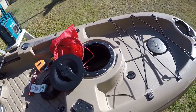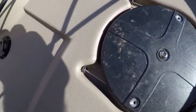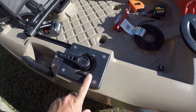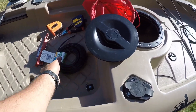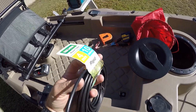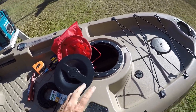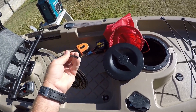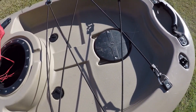What I'm going to do is swap these two wires over, but you'll see they've melted over the ends so you can't just pull them out - it'll be the same underneath, which is a bit of a pain. So I've gone to Bunnings and got 4mm rigid sprinkler pipe. I'm going to have to cut the old ones out, pull them out, swap them over and rerun it. I'll heat up the end, round it off, and then it can't pull through.